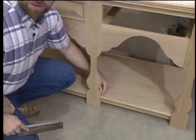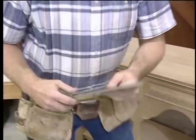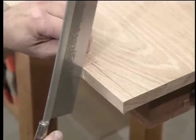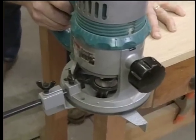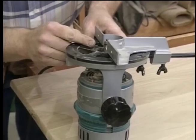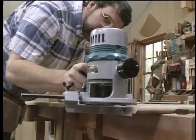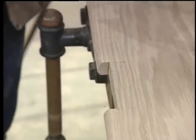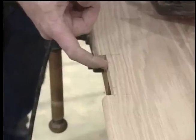Looking at the prototype, the pot shelf is notched around all the legs, and this side cut has to be pretty good because you want it nice and snug. To make that cut I'm using my dovetailing saw and going around to each leg location. I want to make a little bullnose profile on all the edges of the pot shelf, so I'm using a half-inch quarter-round bit, using only the bottom portion of it and a guide fence. To make the rest of the notch for the leg I'm using my hand-held jigsaw — I don't have to be too fussy with this cut because it's going to be concealed by the dado in the back of the legs.